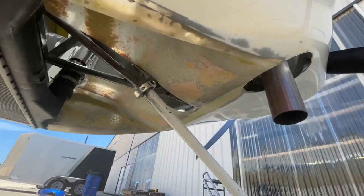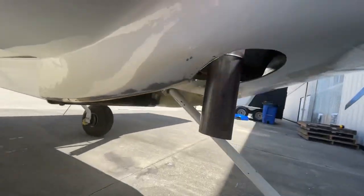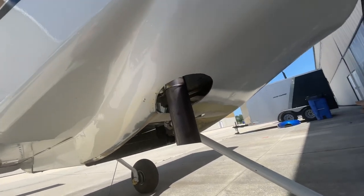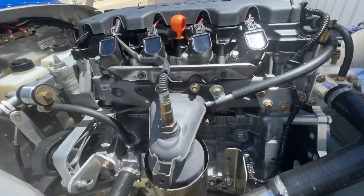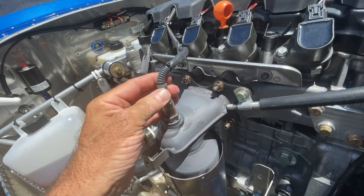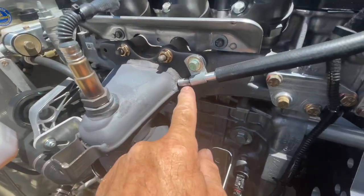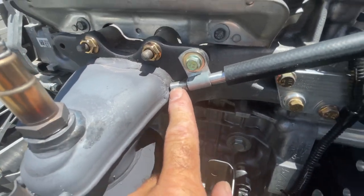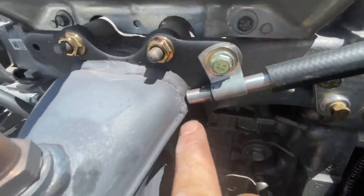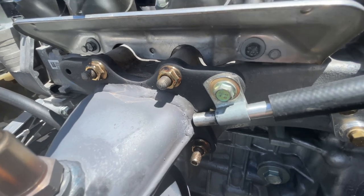The reverse ramp underneath here worked out really good, so that's going to be included in the kit. For the exhaust, start with a smaller hole and you can open it if you need to. The exhaust is mounted to the side. This oxygen sensor is for testing — you won't be needing that, so it doesn't come with it. There's a metal gasket behind the exhaust. Here's the blow-by breather from the cover right here. You're just going to attach it here and have a little piece of pipe touching the exhaust, and any oil fumes that come off just burn up right there.